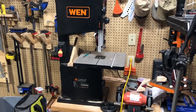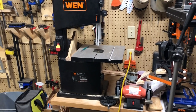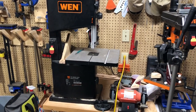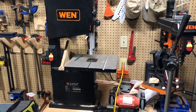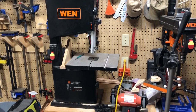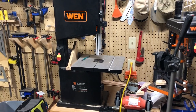That being said, realistically, if you want to cut curves with this bandsaw, you're looking at about $290 because the stock blade is not suitable for cutting anything more than a light, gentle curve. If you want to cut tighter curves, you need to buy a separate blade and that's going to run you about $20 to $30. So you need to price that in when you're costing out this saw if you want to cut curves.